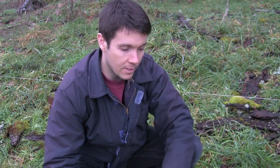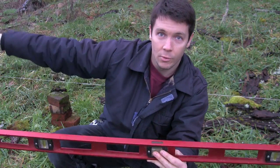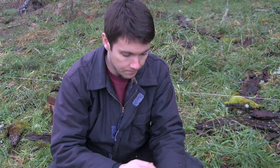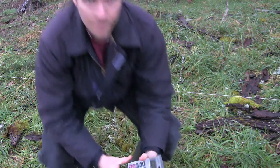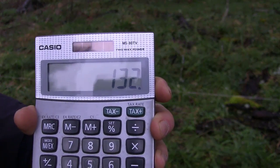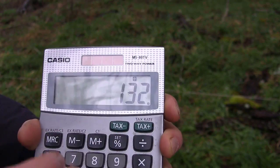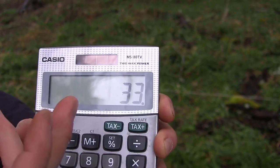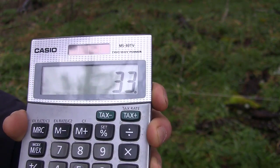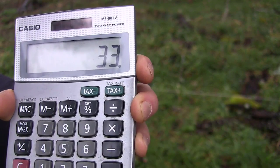So I know that for every four foot — this level is four foot long — I drop one inch going the way I want to direct the water. All you would do from there is get out a calculator. I've got 132 feet from one stake to the other out there. So all we do is divide that by four: 132 divided by four, we get 33. So I know that for every four foot I've got one inch of drop, and with 33 intervals I've got 33 inches of drop overall from the top of the water on one end to the top of the water on the other end. Then divide that by 12.